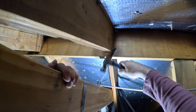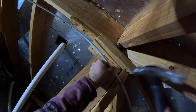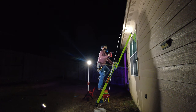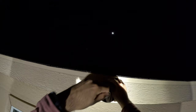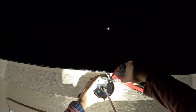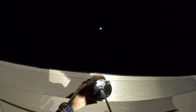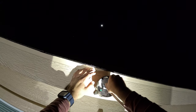Working back to the wire that we just added, I'm installing staples. Make sure you look at your local codes to see where you need to support your wires in the attic. Heading back outside, we're ready to hook up the floodlight camera. I'm going to cut about a foot off so I can get the wire in and start peeling back the sheathing and making up the joints. I'm also going to install a Romex connector on the box — it's a bit backwards, but I'm just using it so that the wire doesn't get pulled into the attic or removed.